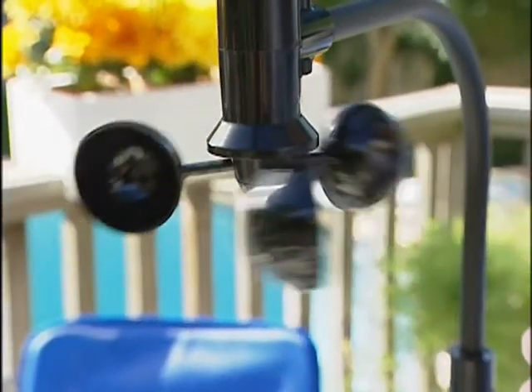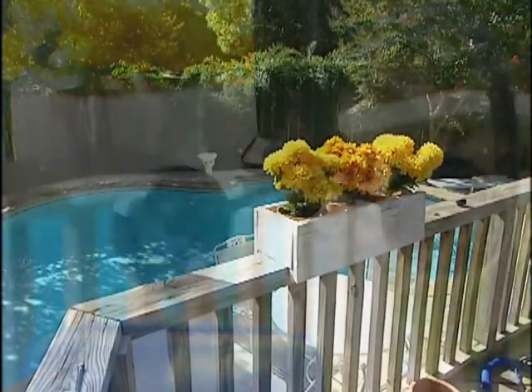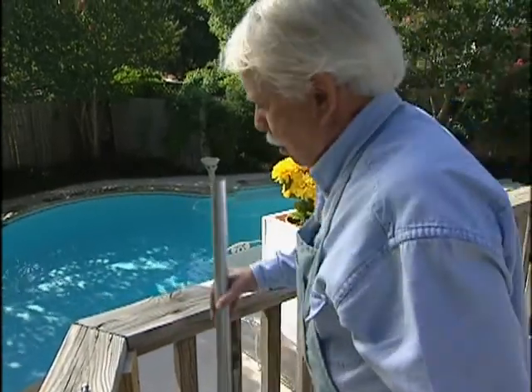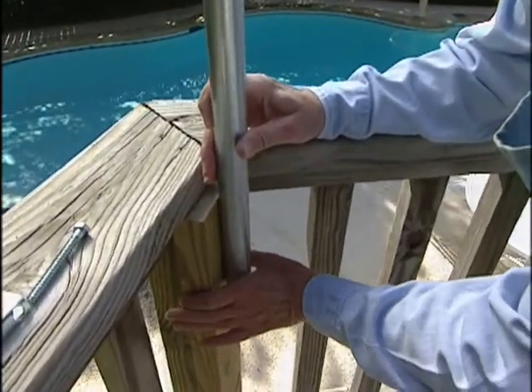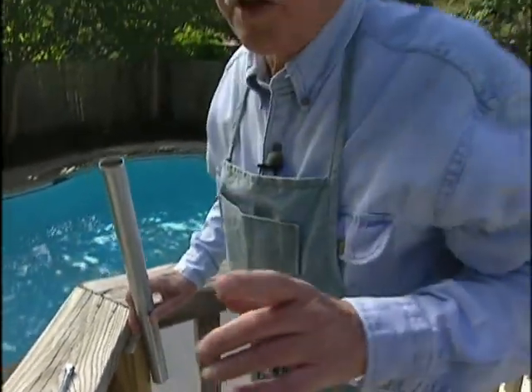Let's see what happens — looking good. Now we're going to install our sensor outside using this mounting tube attached to this post right here. Just like in the real estate game, the three most important things are location, location, location. The sensor can send its data line of sight, so if it's not impaired in any way it'll go up to 400 feet. But if you've got a tree or a wall in the way, it's going to cut way down on the amount of transmission.